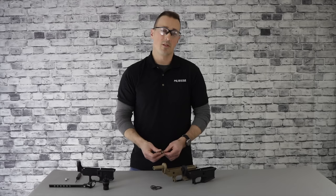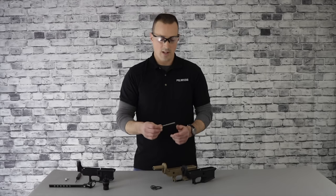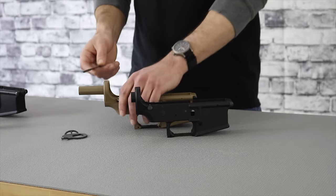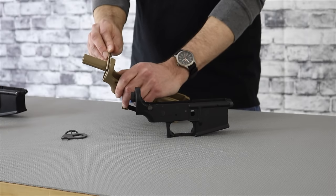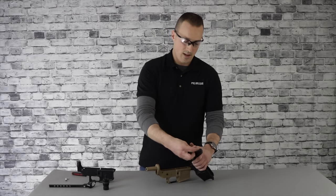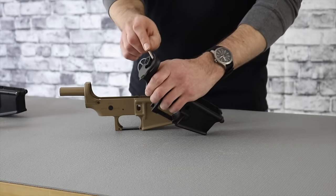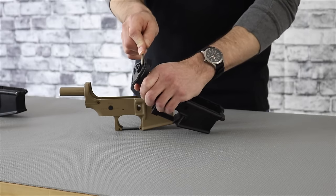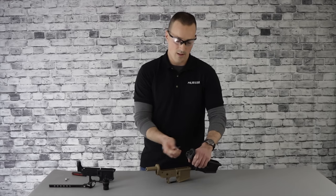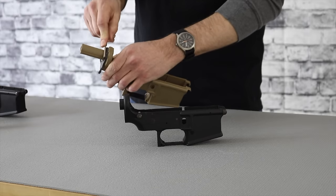When it comes to measuring the stock tail, you can obviously use a scale or a ruler, but another trick is using a drill bit. If you take a 3/16-inch drill bit, you can use that as a guide to mark your cut. You'll most likely find on the lightweight receiver that you'll only have to use a belt sander or sanding block to remove a little material from the end to make the right length — there's only a very thin amount sticking out. However, on a traditional full receiver, you're going to have to remove quite a bit.